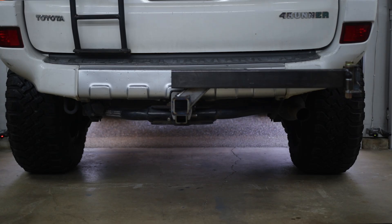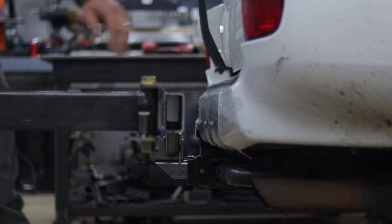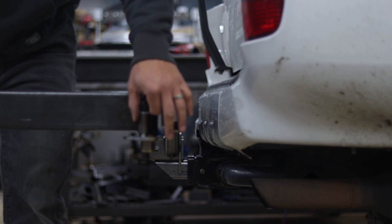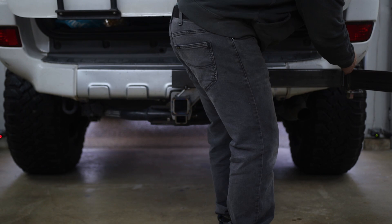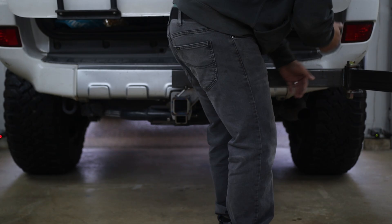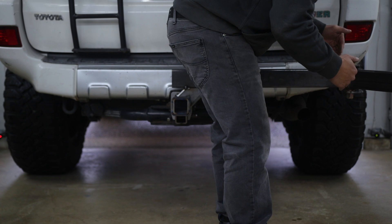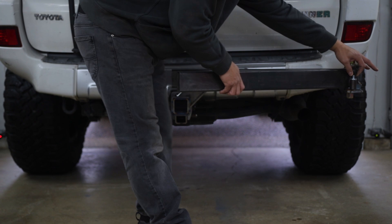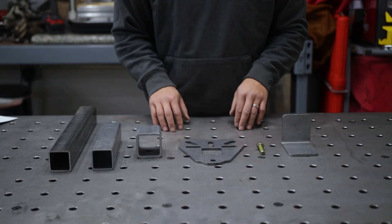On the car, the arm is in line. Opening it up, it clears the lift gate no problem. I could probably make it about an inch or two shorter — nothing is going to hit here and the swing arm is pretty clear of the lift gate. If that's the case, break off the tacks, take the arm assembly to your chop saw or bandsaw, trim an inch off, and slide everything over.